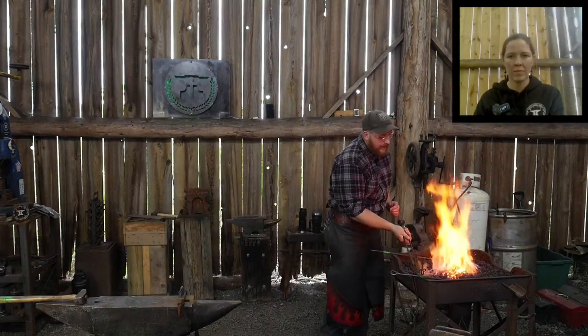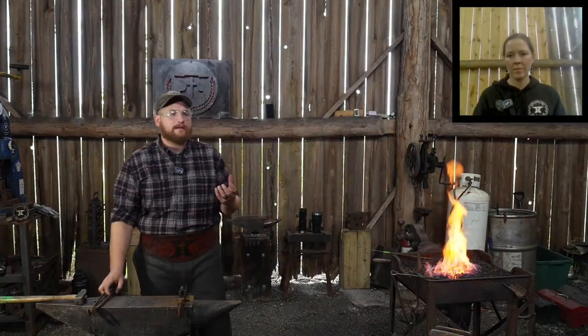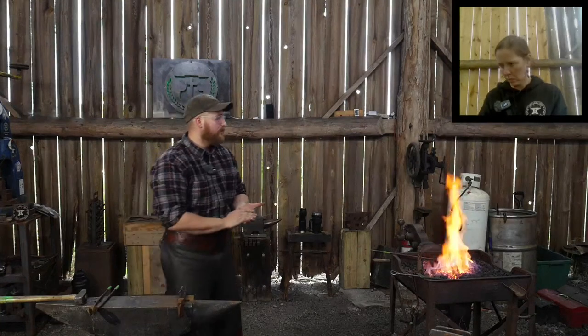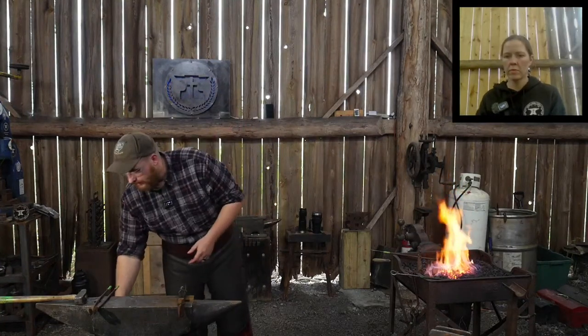There is cause to have fabricated swedge blocks as well, where, say, if you just need the V's, you can cut a piece of angle iron, or three pieces, stack them together where you've got a V in the center, and weld them up. You can make a welded together, fabricated one. So there's a lot of different ways of going about getting a swedge block.